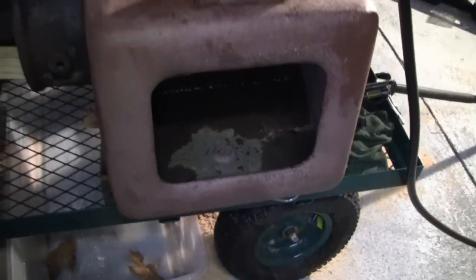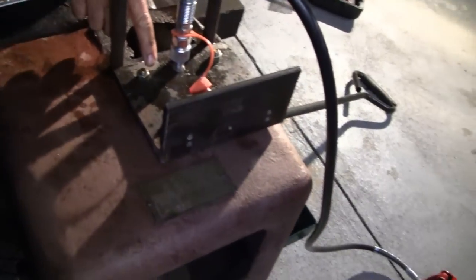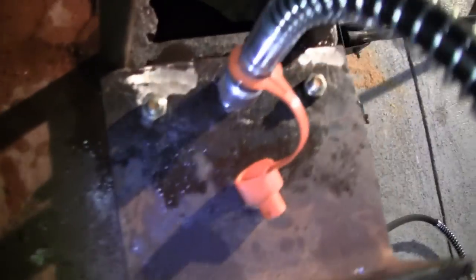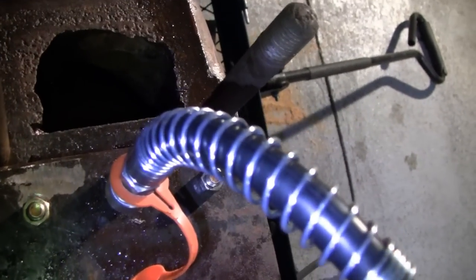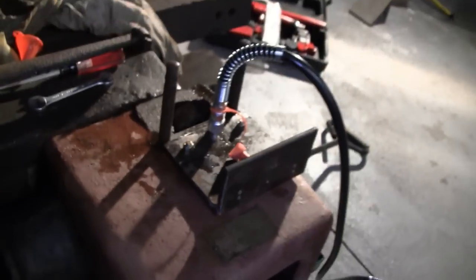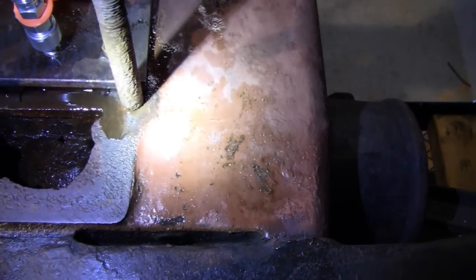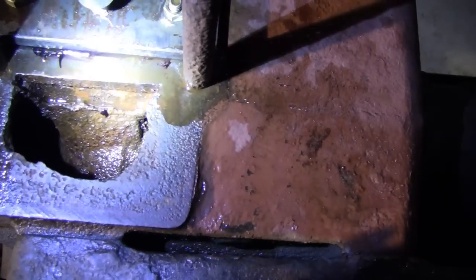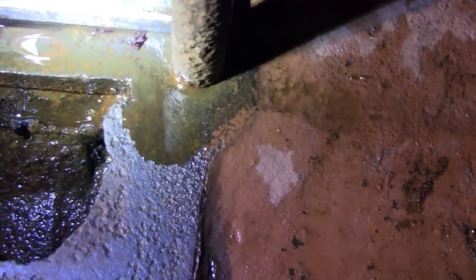Okay, crack the engine. Look inside the water jacket. Oh, jeez. You got moisture in there. I don't know why. When this overflowed, it ran down. Oh, down? Oh, look, I think it's oozing out a little bit there. Yeah, right, it's starting right here. Not too bad, though. Let me tighten her. Hmm. All right, we're pumping it up, but we're just not getting a seal there. You can actually see it. It's under pressure now, but you can see it actually moving.